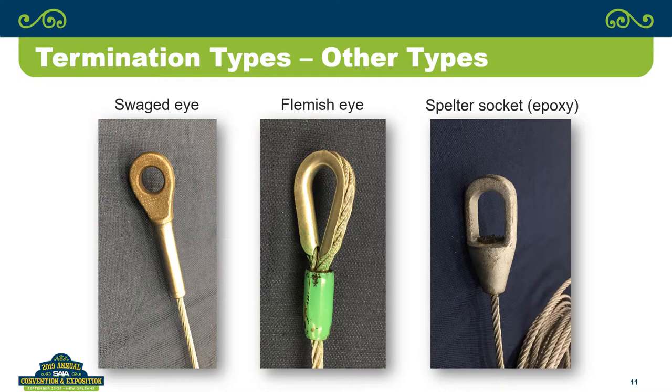Traditionally in our industry, Spider's 15-inch braided back into itself eye was called a Flemish Eye. And that's what I've always understood that to be, was that braided back into itself, not seized with wire, anything like that, just braided back into itself. The guys at I&I Sling call what you have there a Molly Hogan. They don't take the wire and put it back into the sleeve. They separate it and then twist it back into itself, which you can't do with 5-strand wire. The old 6x19, 6x31, you could do that, but it doesn't work as well when you have an odd number of strands go back in. We do it with 5x26 and make Flemish Eyes, but just like that. Yeah. I think they're both Flemish Eyes, actually.